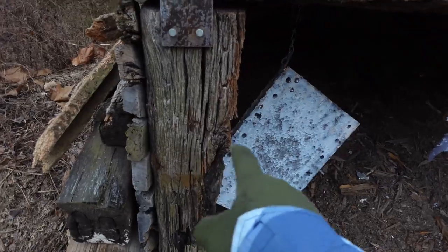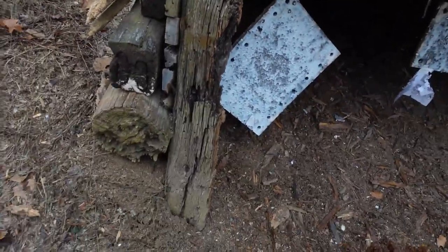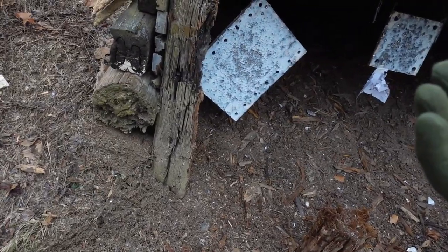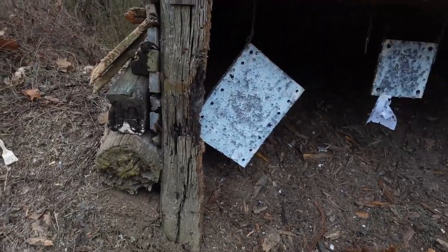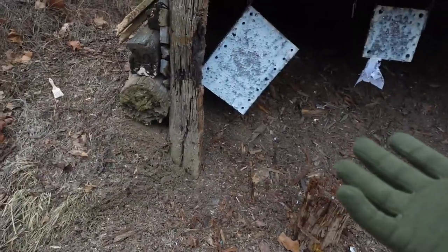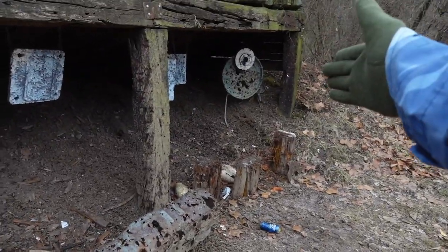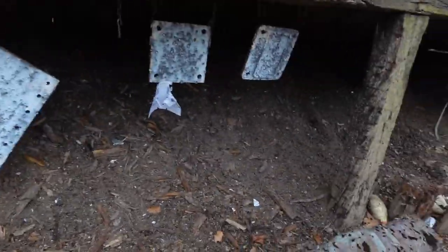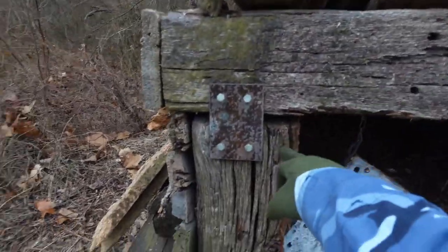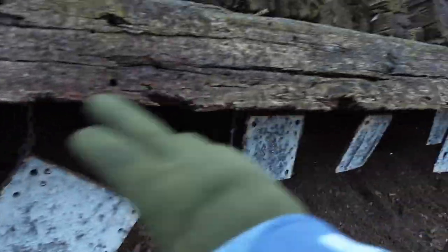The basic way this shooting range is constructed is we took railroad ties. Railroad ties are harder to find these days because the EPA hates them since they leech tar into the groundwater. We found a lady whose husband had collected rail ties — probably around 20,000 of them, like a pyramid 100 feet tall going for about a quarter mile long. We got some rail ties and built three posts buried down about three feet, done with shovels, packing dirt around them to get them upright and straight. Then we set ties up on top and used little gusset plates — basically steel stock that we drilled holes in to stick lag bolts through — to give it some rigidity. That made our uprights.